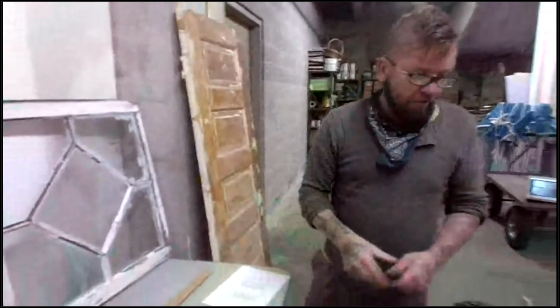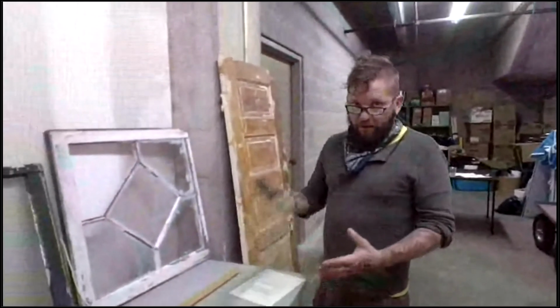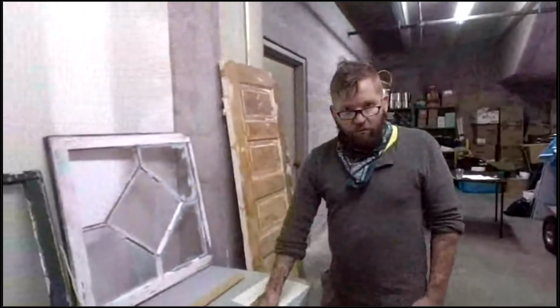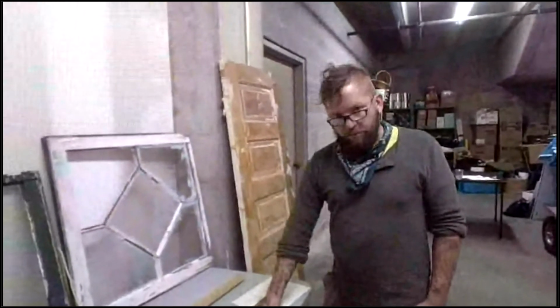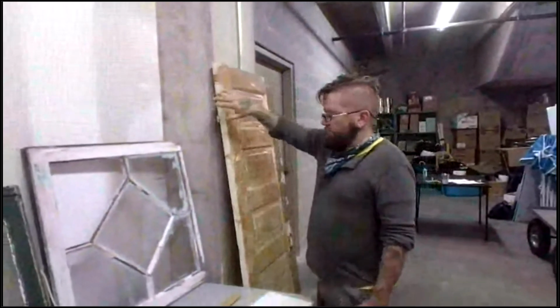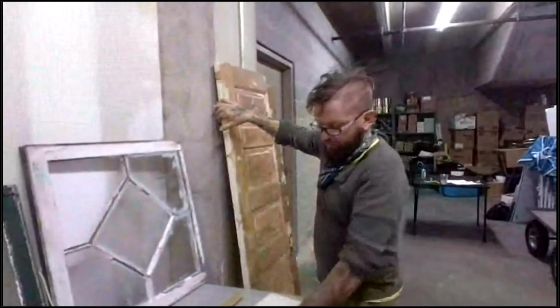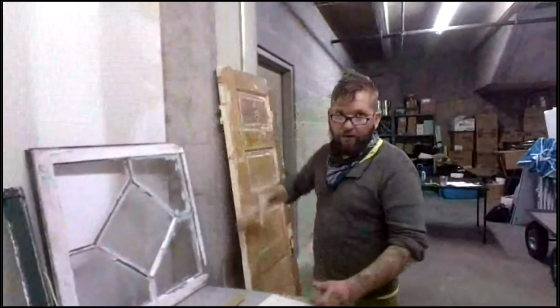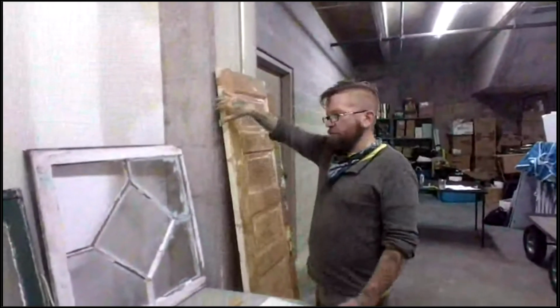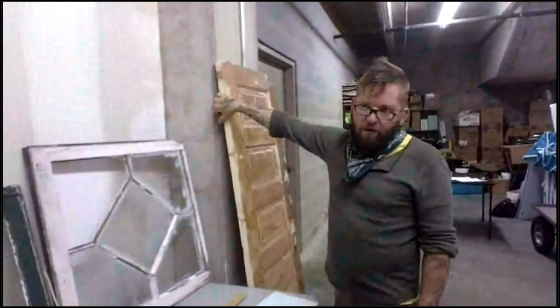or something, and you can lift the door up, and while it's open, so you can access your hinge screws, basically use a putty knife to hold the door up in place and take the pressure off the hinges. You can just shove the handle of the putty knife underneath the door, and it'll hold it up level. And like I said, take the pressure off the hinges. Then you can lubricate the hinges.